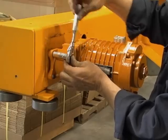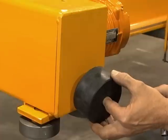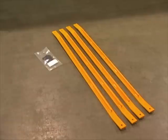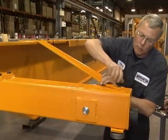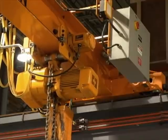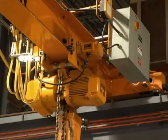After the end trucks are attached to the bridge girder, attach the drives, or motors, to mounting locations on the side of the end trucks, and install standard rubber bumpers to the end of the end truck frame. Typical systems include four braces for motorized cranes and two braces for manual cranes. Per the owner's manual, connect cross bracing and other components of the bridge beam accessory kit. If more than one crane is purchased, end trucks are match marked per crane system. Note: holes are pre-drilled and connection is also bolted. Bridge beam accessory kit includes trolley stops, bracing, bridge beam mounting plates, festoon wire brackets if ordered, control panel bracket, and all necessary hardware.